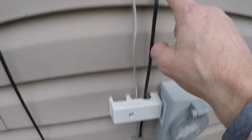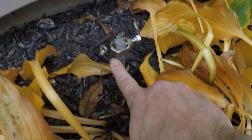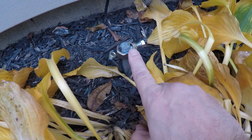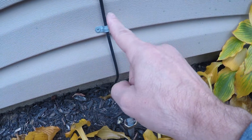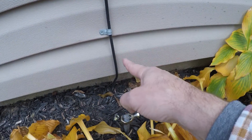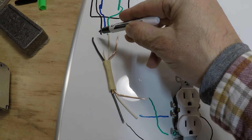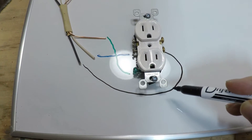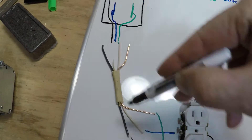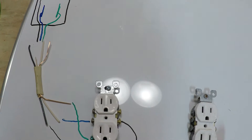Out here we've got the panel with a ground wire coming down, under the mulch, and up to a rod driven deep into the ground — that's the ground wire. So in any accident or short, instead of that power going into you or something in the house, it comes back down into the ground. The way power flows is through the hot wire into your device or outlet, then circles back through the neutral wire — it makes a constant circle. That's how electricity flows.